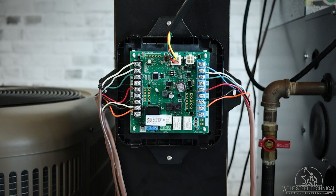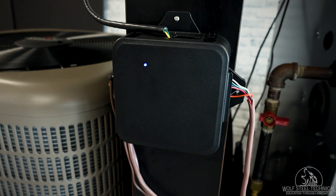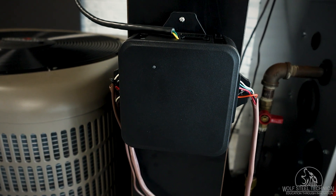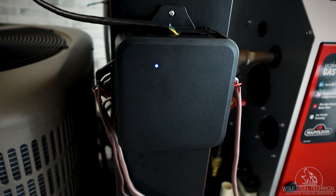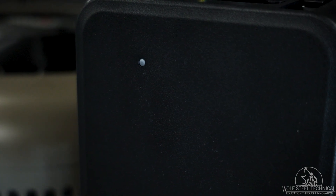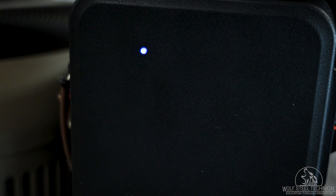The mitigation board hosts an LED which will provide a status on the system's operation. When the LED is flashing green, the RDS is initializing and no action is required. When the LED is solid green, it indicates that the RDS is monitoring and no action is required. If a blue flash is present with a solid green LED, this is an indication that a mitigation process has previously occurred in the system. When the LED is flashing blue, a leak is detected and the system needs to be checked and repaired before restarting the equipment.